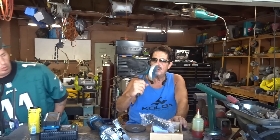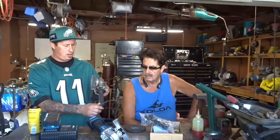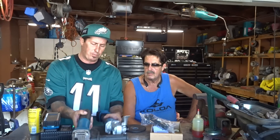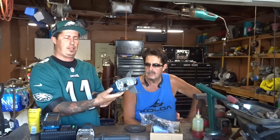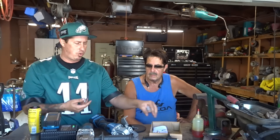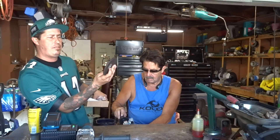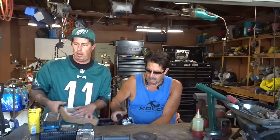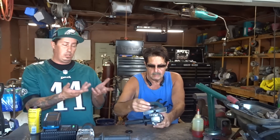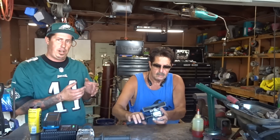There are going to be a couple of differences between the 110 volt and the cordless. On his 110 — the same exact one that I have — if we just unspool the wire real quick, the first thing you're going to notice is that this one has the paddle style trigger. The Hercules cordless option has the typical push-to-lock button that stays on constant as you're grinding. What all does it come with? Of course you get your safety handle for more stability and control, your locking tools to lock down the disc, and they do give you one grinding disc — a five inch by one quarter by seven eighths — though you can go down to a four and a half inch, meaning you can use sanding discs, a grinding disc, or a cutoff blade.